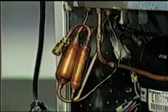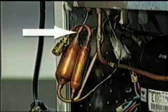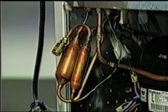Be sure and get 1/2 to 3/4 of an inch of capillary into the dryer to assure that you don't weld the end of the cap tube shut. Insert about 1/2 inch of the hot tube outlet into the dryer filter.